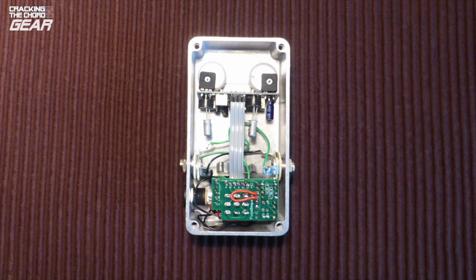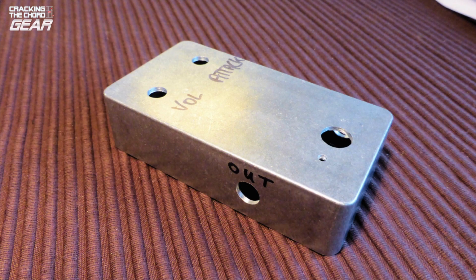The hard part in putting together a pedal is assembling each board. Putting the boards, jack sockets and power socket in the enclosure is pretty straightforward. Here are some tips on making the process as smooth as possible. Mark each socket and potentiometer location on the enclosure with a Sharpie. As you're working upside down, it's quite easy to mix things up if you don't.